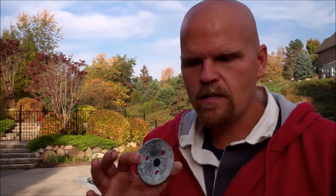it doesn't matter what it is — if you don't have a soft piece of metal, a piece of zinc in particular, that the electricity can be attracted to, the electricity instead attacks the pool equipment. What happens is you get a breakdown of your equipment, it deteriorates much quicker, versus having this simple little piece in here, which becomes a sacrificial anode.